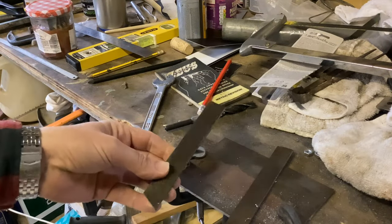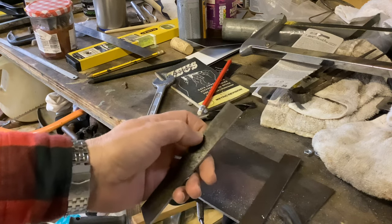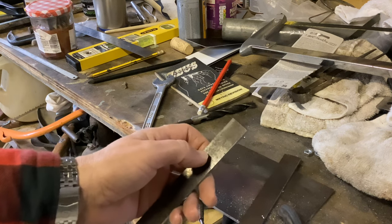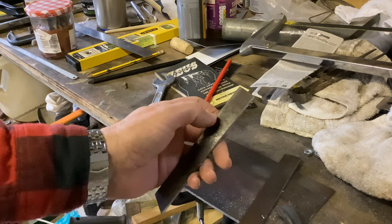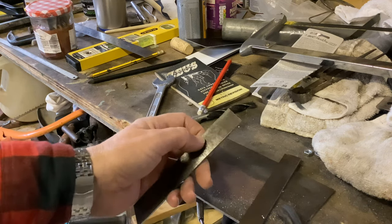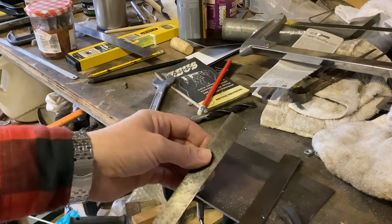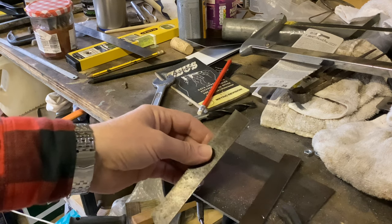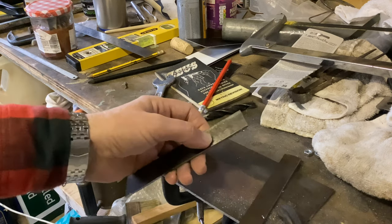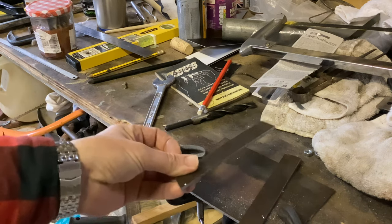Well, that didn't take long. There's a bit more material here than I need and I mark them out probably wider than convention would say. The minimum width for the fitting is really 3 clevis pin diameters, and the pins I'm using are 3/16, so the minimum width should be 9/16. But I'm going a bit wider — something like 3/4. There's no harm in having a bit more material; each fitting is only going to be an inch and a bit long. I think we'll go next door — it's warm in there, the dehumidifier has been on.